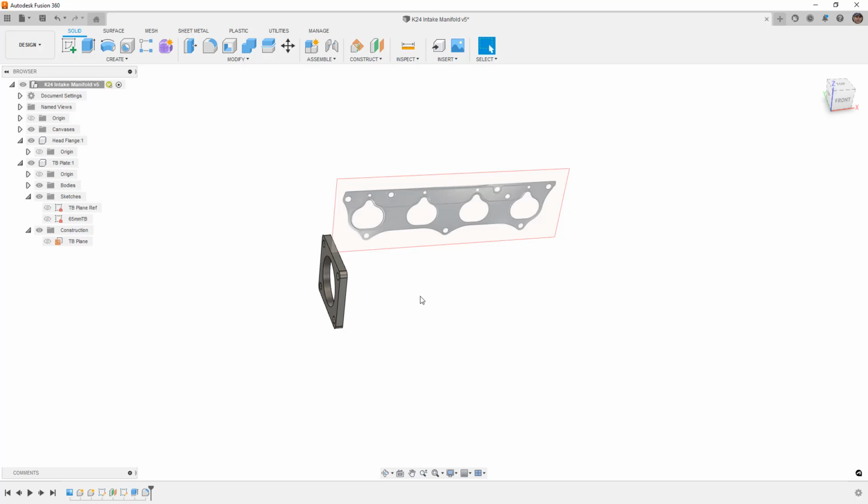When I have parts that rotate around, oftentimes I will ground one of them because we need a base to make sure that not everything moves in space. So in this case, again, not a big deal. You can ground it if you want to, but the reasoning behind it is because Fusion wants to know exactly where our coordinate systems are. Right now we don't care. We know where they're supposed to be. We'll revert the position. Let's do a quick save to make sure we don't lose anything.